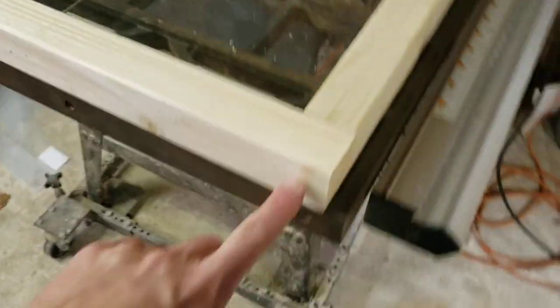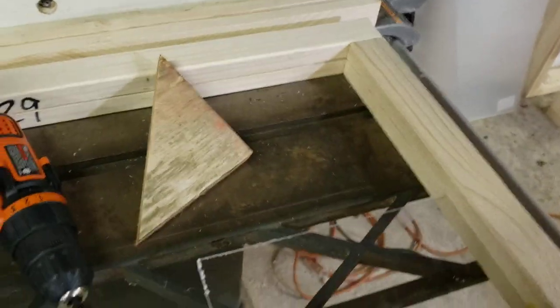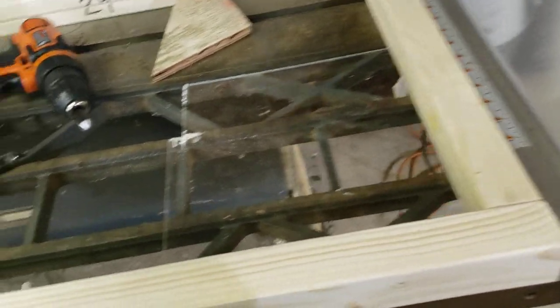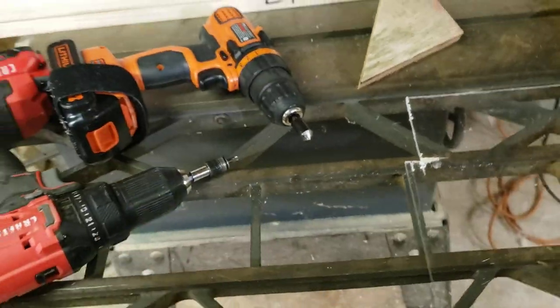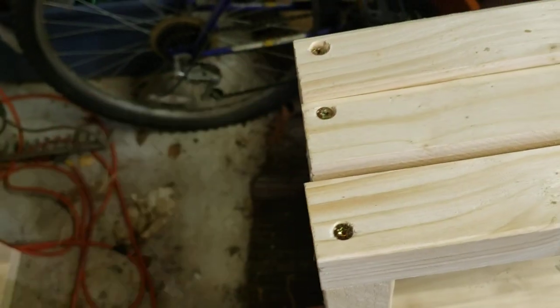I cut the grooves. With one screw in here, I am drilling a hole and then counter-sinking it. I'm pre-drilling and counter-sinking to not split the wood, because we're dealing with pine only — I'm not rich enough to do that fancy cedar stuff. Then I'm taking three-and-an-eighth inch screws and screwing it all the way in, so it sits flush and is recessed slightly. Then I'll come back through with that corner piece to beef it up a little bit.